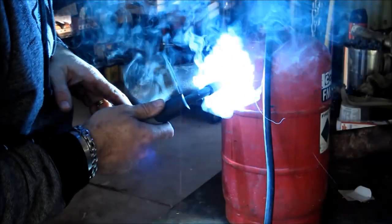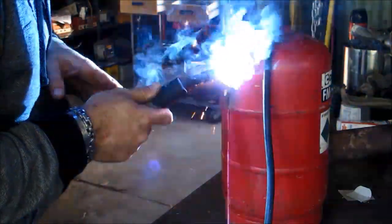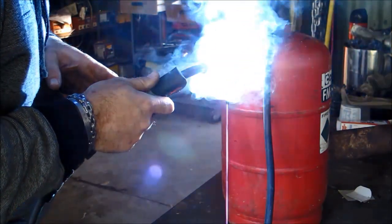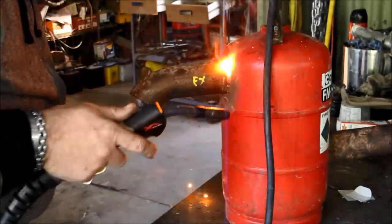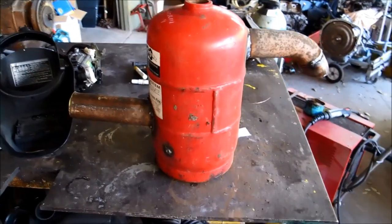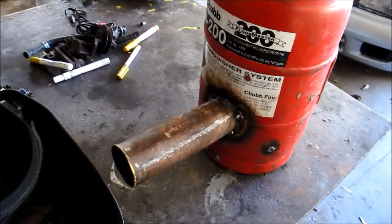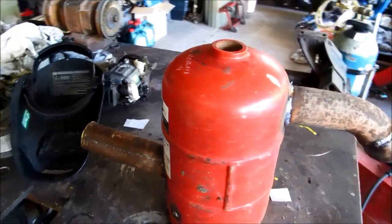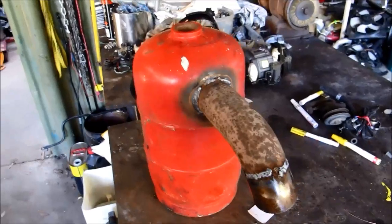The main thing with these type of burners is not what size bottle you use or the inlet and outlet size of the pipes — it's just basically making sure that you've got a bit of swirling going on for everything to mix and to keep the bottle hot. Here you can see the profile view of the bottle: it's simply a pipe in one side at the bottom and another pipe going outwards from the top, the inlet and the discharge.